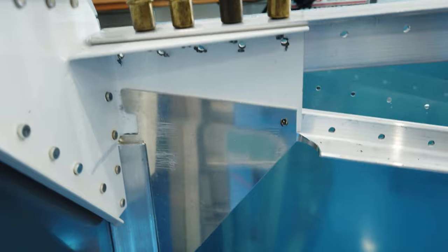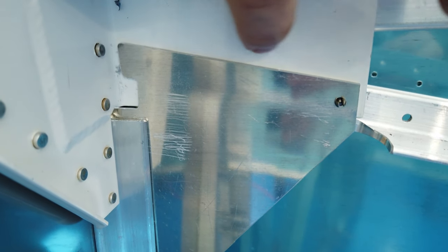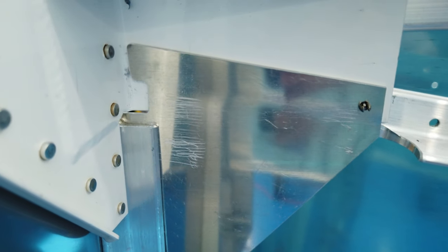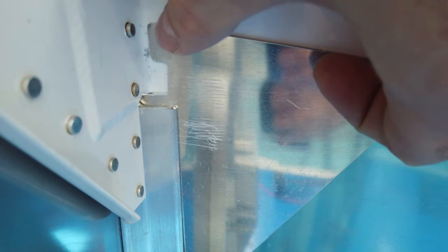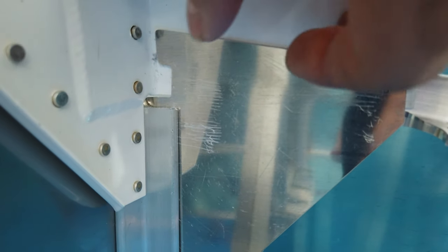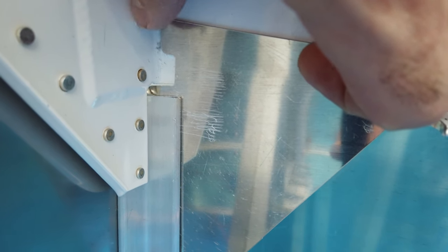Oh, so you can see how the gusset lays against the aluminum here in this corner. It's very close. Nothing that a couple of rivets can't draw in. I mean, it's minimal. And then you can see across the top here, it's nice and tight against the metal bracket. So those bends are very, very close, and I'm happy with that. You can see this dog ear here is not rubbing up against the powder-coated bracket. This little ear here is not interfering with the bracket.